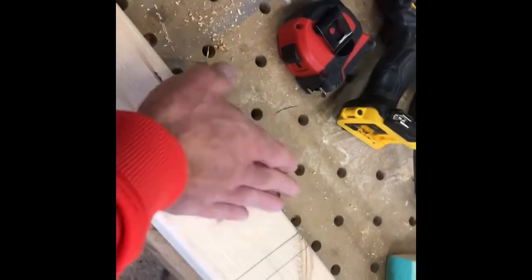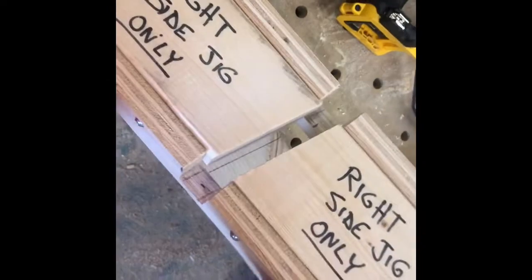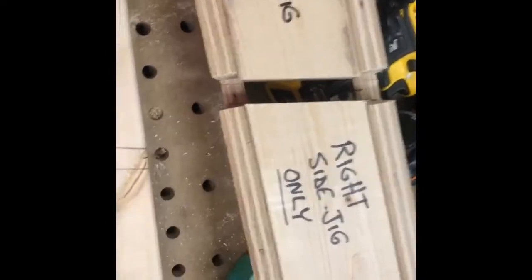What's really critical is that the other piece is the same — it's going to be a mirror image, but the measurements are the same. It is nice to have these shelves spaced out, and if you want it to be like the sample, those are the measurements I used. Then I took my jig after I found the centers, pushed it onto the mark, lined up the mark I already put on here, and traced the jig to know where those would be. You have to make sure you're using the right jig — this one says right side, and it should be going the same way as this angle. If you use the wrong jig, all these will be backwards.